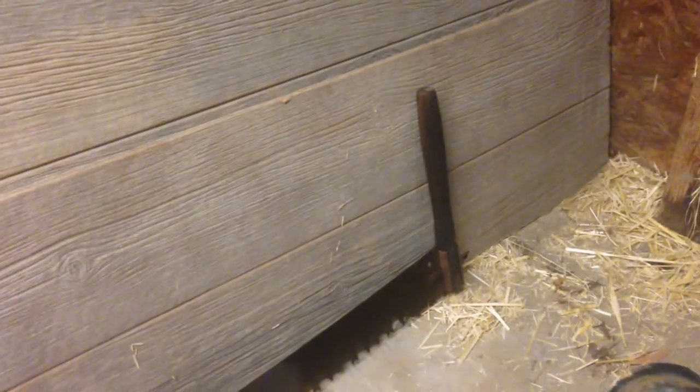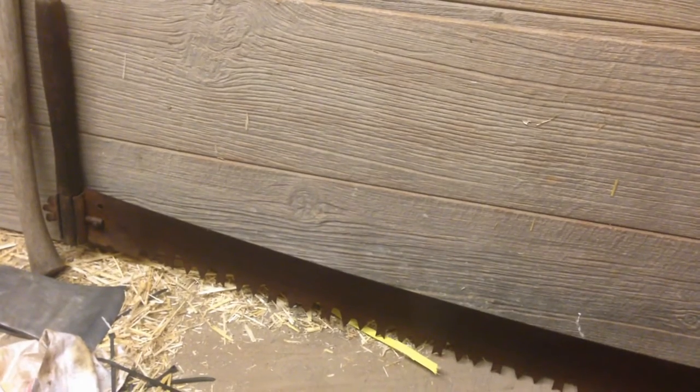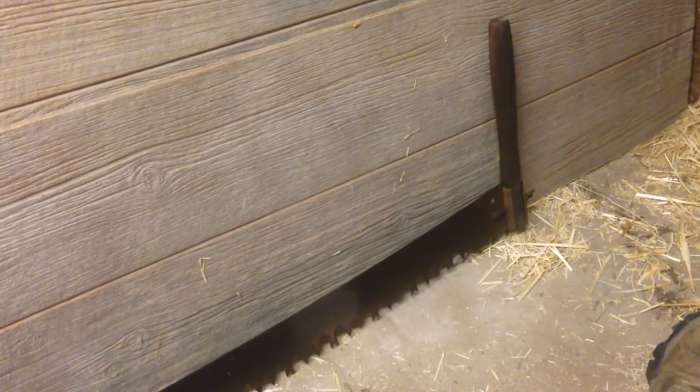Alright, here's the done-for-tonight edition. I removed both handles, hit them with linseed oil, sanded the blade by hand with 220 grit sandpaper, then wiped it with mineral spirits until the cloth came back mostly clear. If this saw cuts this weekend — if my wife and I can get it to cut trees — then I'll spend more time on it. The teeth looked to be in fairly decent shape. I didn't see any markings. I don't know how old it is, but we'll see.